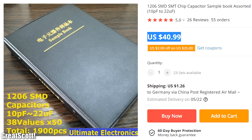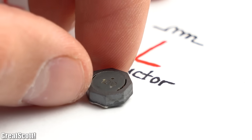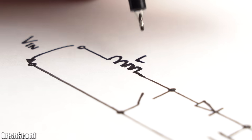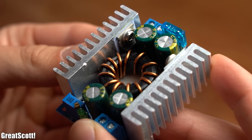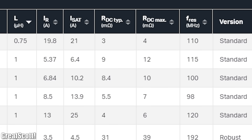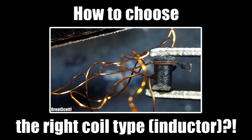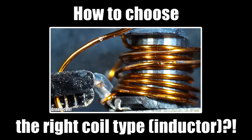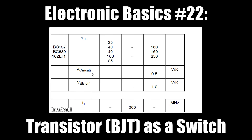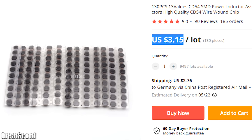And once again for SMD circuits, I recommend a 1206 SMD capacitor book. Last but not least we got inductors, which are mostly used as energy storage devices for switch mode power supplies, or to build up filters. In the first case your choice of inductor truly depends on what kind of power supply you want to build, and thus it is advised to search for specific ones when you know the details of your circuit — as covered in my video on how to choose the correct coil. For building up filters on the spot however, I would recommend a power inductor kit.